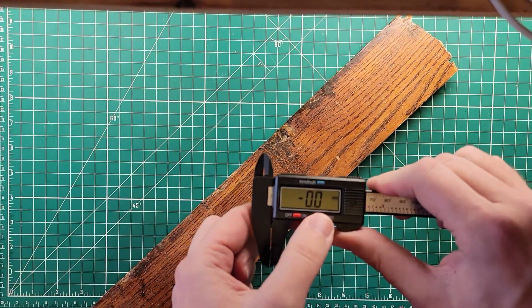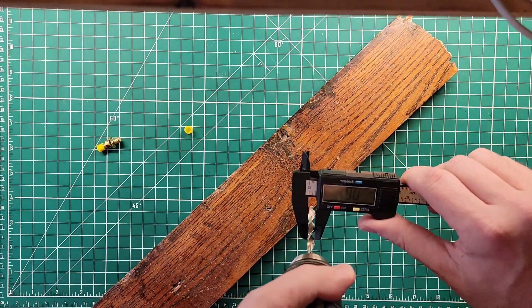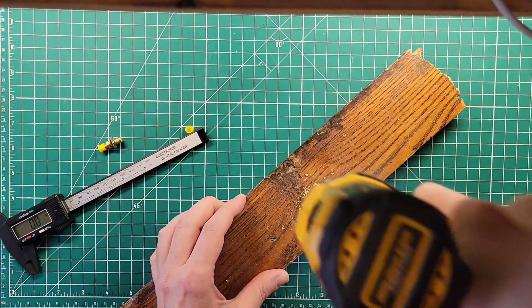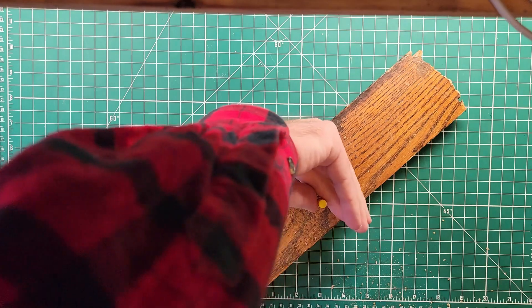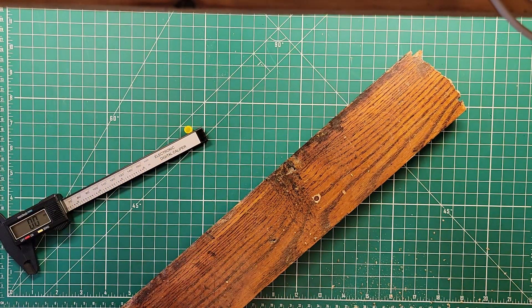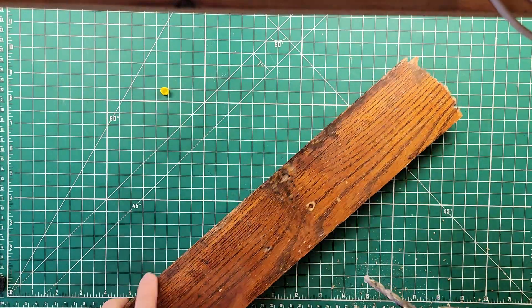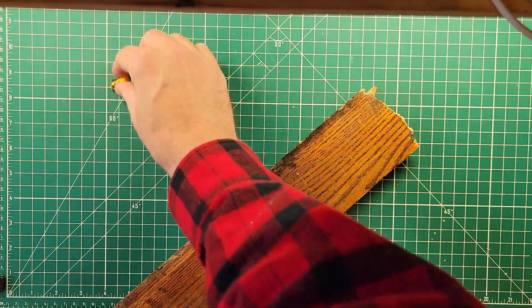I've got my friendly micrometer here, and what I wanted to do is zero it out and then measure the diameter. The SMA connectors come out to six millimeters in diameter. I'm gonna try a 5.5 millimeter — nice tight fit — thinking it might screw in to the side of the case and give me just that much better of a weather seal. And then I also tried a 6 millimeter just to see if I like that, and it's way too loose. I don't like that.